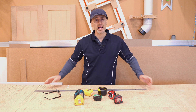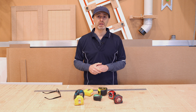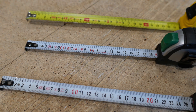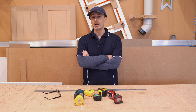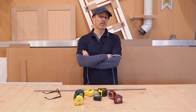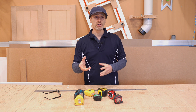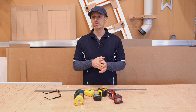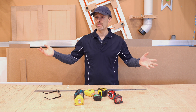In the carpentry world, making frames, it's not too critical — it may not be a big deal between a class 1 or a class 2, because generally most tape measures you pick up at your local hardware or tool supplier are going to be class 2. But in the cabinet making world, where we work to the millimetre, 2 to 3 millimetres out may make a difference. Stick around, because I'm going to show you an alternative method to get an accurate measurement over a long distance even without a class 1.